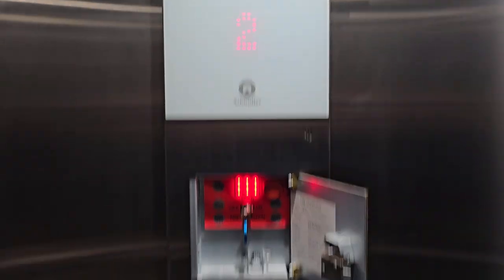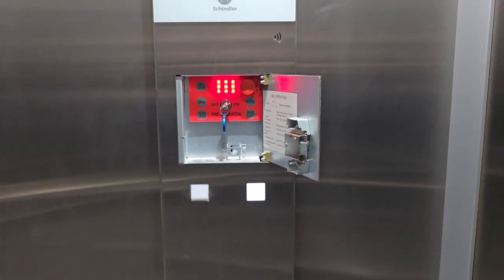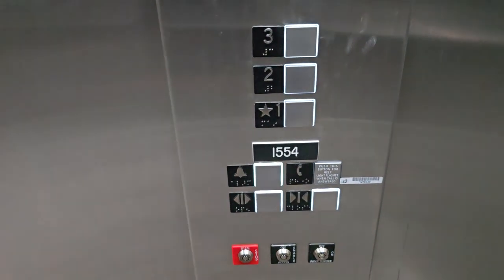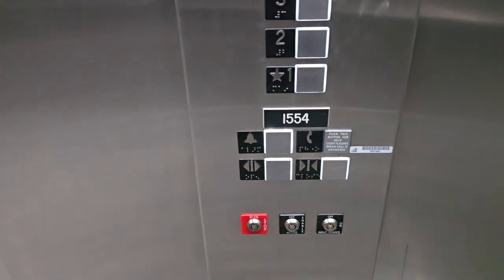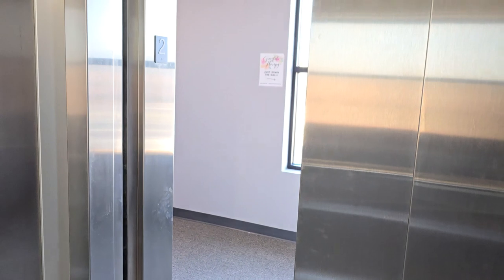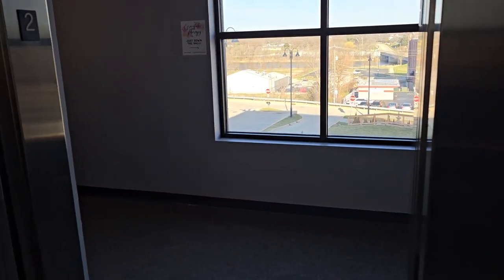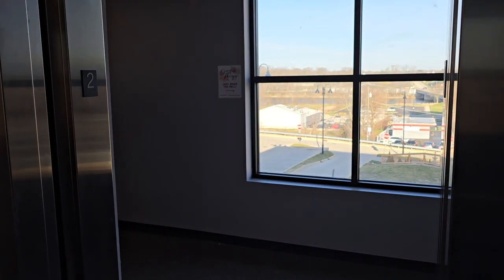The floor pass chime is disabled in fire service. Now it's at two, but notice the door is not opening. This is for safety — if there's fire, you do not want that door to open. To open it, you have to hold door open. Say you see fire out there — let go, and the door is going to automatically close back up. Another thing to point out: the safety eye is disabled in fire service, because it can't tell the difference between a human and smoke.